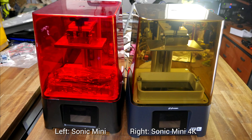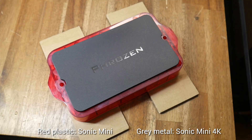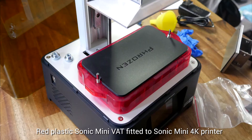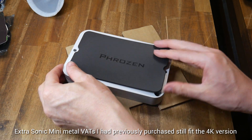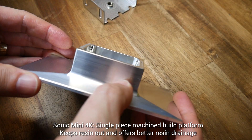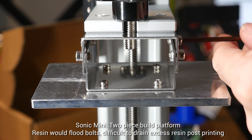Before all of this, however, I took the chance to directly compare the Sonic Mini with the Sonic Mini 4K. The exterior dimensions are identical — only the color of the lid has changed. Comparing the build platforms, the 4K version is slightly larger, which is particularly clear when we overlay them. The dimensions of the vat are pretty much the same, as we can see when we put the new metal vat over the top. The material of the vat has been upgraded from plastic — which, according to comments in my last video, is prone to cracking — to metal, dimensionally very similar to previous upgrade units for the Sonic Mini. Another improvement is in the shape of the build surface — it's now a single machined piece, angled up to prevent resin getting into the top, compared to the original Mini where resin would flow in and surround all of the bolts.